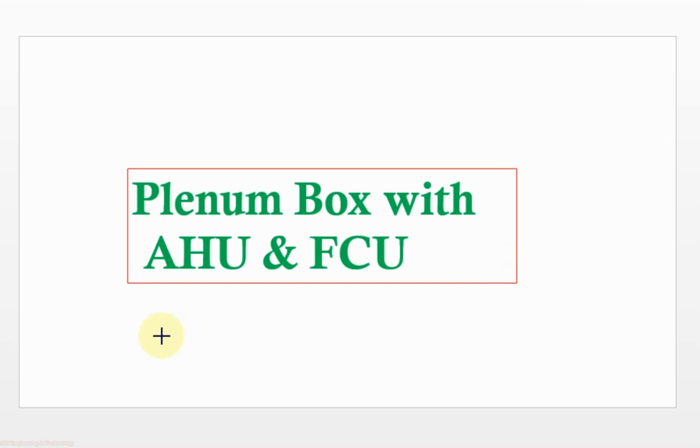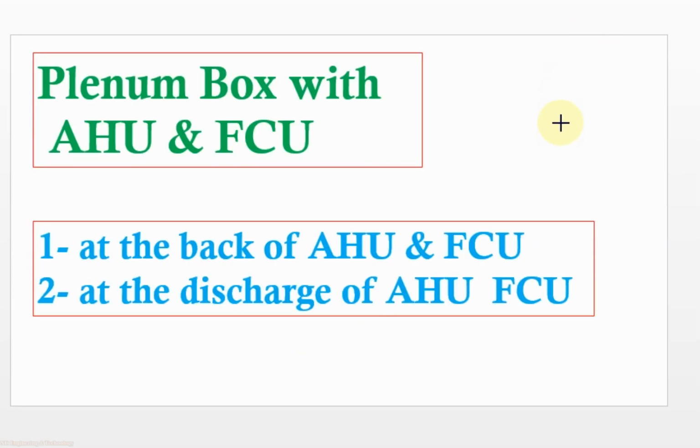Why we use a plenum box with AHU and FCU, and how to calculate the size for it. The purpose of providing a plenum box at the back of AHU and FCU is, number 1, to mix the fresh air and return air for the AHU and FCU.